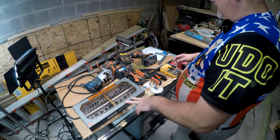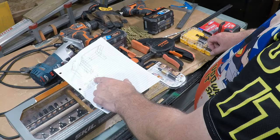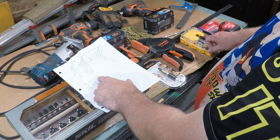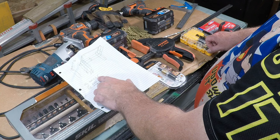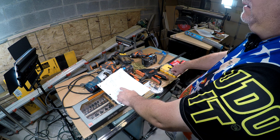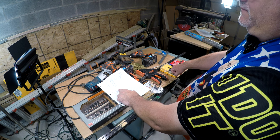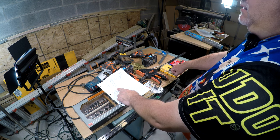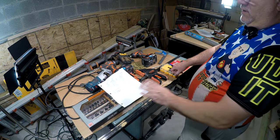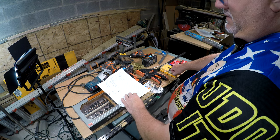And the lumber that I have is, I got a 4x4 by 10, and we'll cut them down to approximately 2.5 feet. The 4x4 by 10 is really 4x4 by 10 feet, 1/2-inch. But we're gonna make 3 cuts and square off the edges, so it may be slightly less than 2.5 feet each. But whatever we choose, we'll make sure that they're identical across all 4 of them.